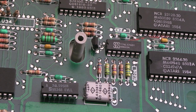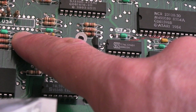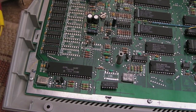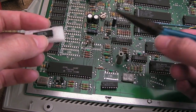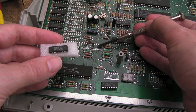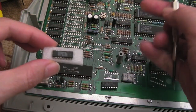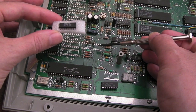And then the Atari chip — the interesting thing with this is it's quite a small chip. U34 is quite a large socket there, so I'm not quite sure where that goes. I was under the assumption from something I'd read that we'd need to put a 74LS95 down here and then this Atari chip — or a GAL or PAL. I remember finding an article suggesting you could program a GAL or PAL and stick it in this slot, filling the same DIP profile. This Atari part number C025953-20 is supposed to go in U34, but obviously it's smaller, so my first thought was it's left-aligned — but is it the right chip? It is a larger profile socket.